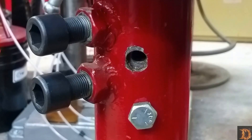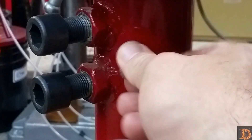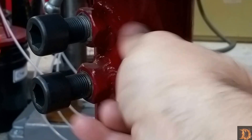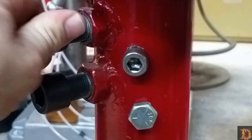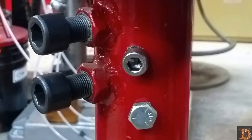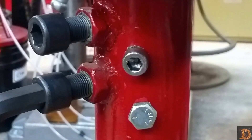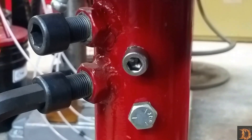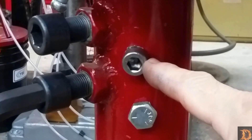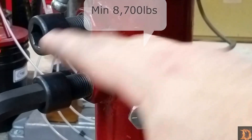As you turn the vise you have four positions. This is position number one. You take your socket head cap screw — that's half-inch 13 — and you put that in there. When you tighten that down and clamp these down really tight, that makes this vise effectively a rigid vise in this position. That half-13 has a shear strength that is unbelievable. Your vise will break or the work will bend or break before this will ever move.